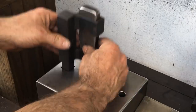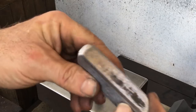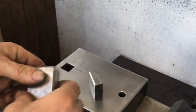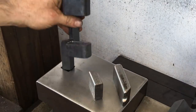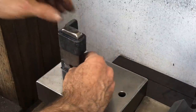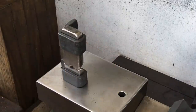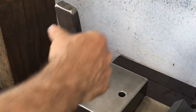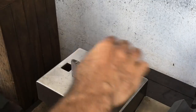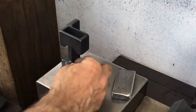I took the die set from much earlier on that I frequently use, chamfered the edges, and also took a little bit off the face and sides to see if that would work with the pipe guides. Lo and behold, they fit — maybe a little bit loose but still fine. One possible issue after expanding the throat opening is that the top die doesn't protrude very much, and if the top die mushrooms, that could be another potential problem — so I'll work on that.